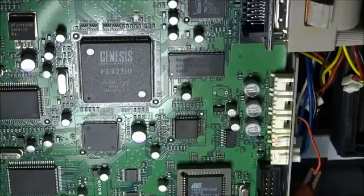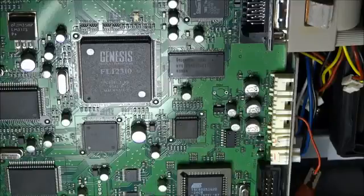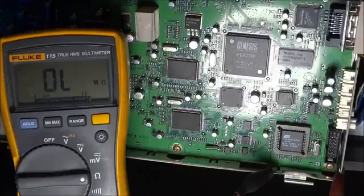Yeah, it certainly looks like the very top one is defrosting. Yep, there it is. It's a very quick change. So it is defrosted. The other 2 capacitors below it are still frozen looking. There they go. Okay, so I'm going to take that capacitor out of the circuit, and we'll try it again. Alright, so I went ahead and replaced that capacitor.